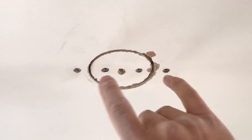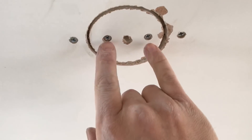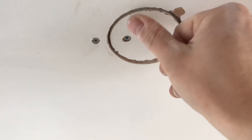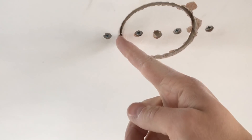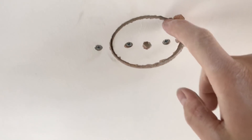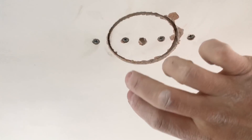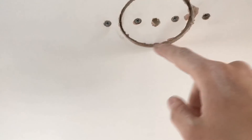Simply screw that up to the timber. This is what you end up with — two screws holding the timber, two screws through the plasterboard — and that is solid now. That little plug. What you can do now is run some sealant round here and let it go off, but I've never had a problem with just putting filler on these. For the purpose of the video, I'm going to put a tiny bit of expanding foam round there.